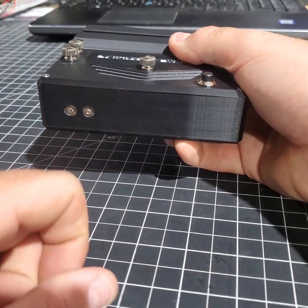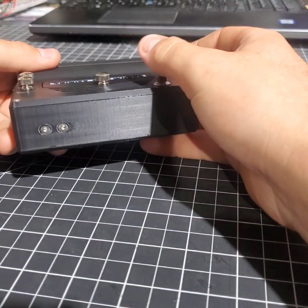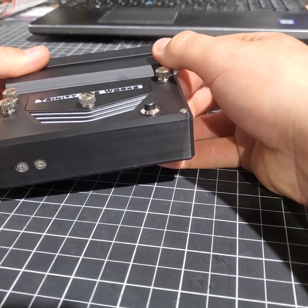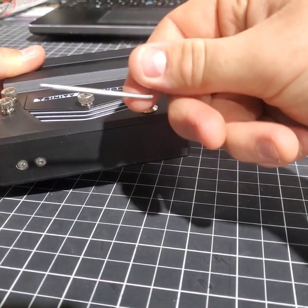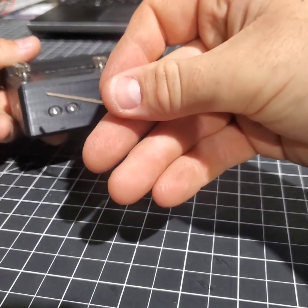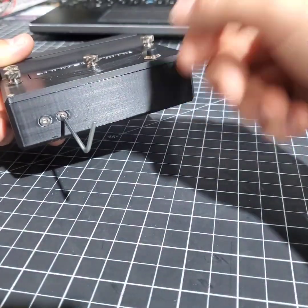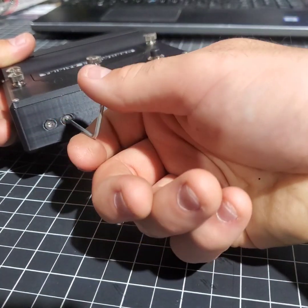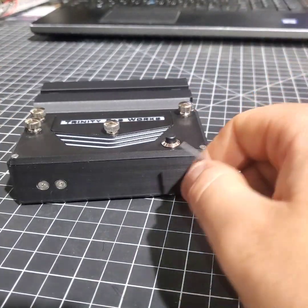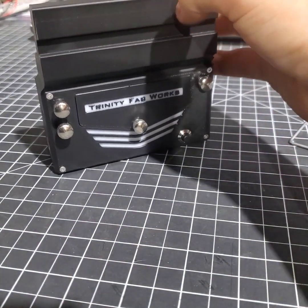Whatever you do, don't over-tighten these two bolts on the bottom - they're small allen heads that are countersunk and they seat on plastic. If you strip these out they can be hard to get out, but if the allen key turns without turning the bolt, you can take the little allen wrench, heat the end up with a small butane torch or a lighter, stick it on the end of the bolt and hold it in there for about 10 seconds. It'll warm it up just enough to loosen it and makes it really easy to pull out. Don't heat it up with a rosebud though.